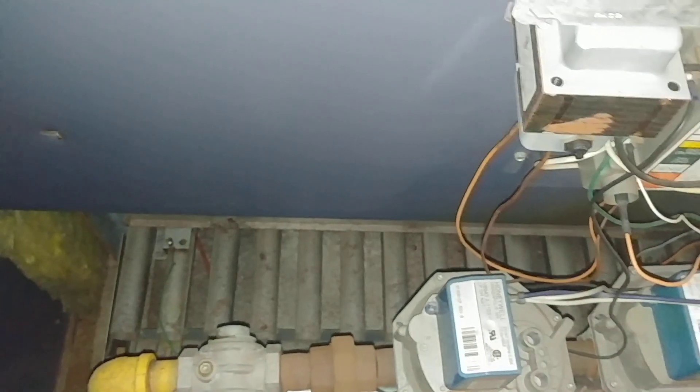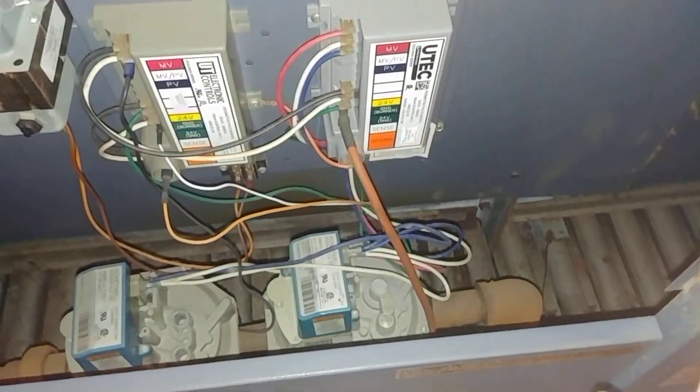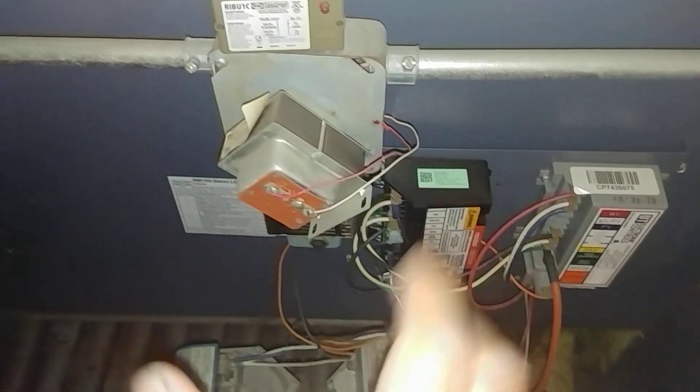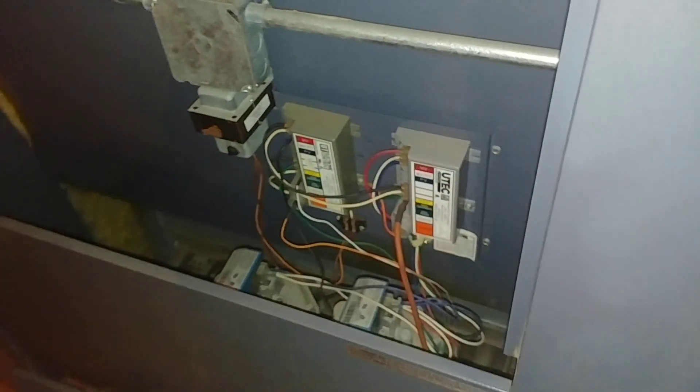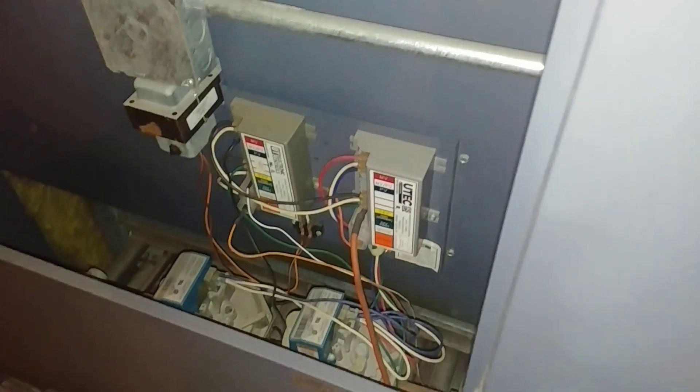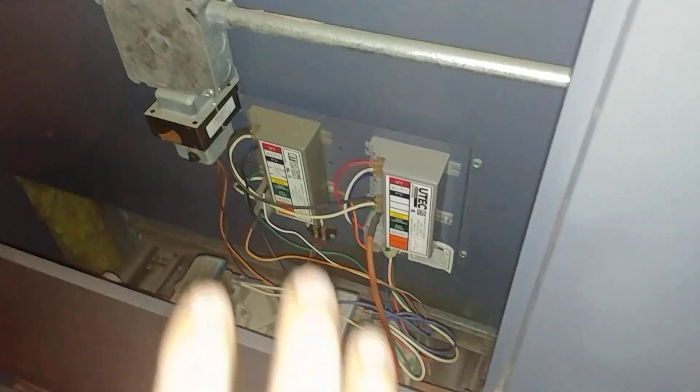There's our focus — it's two smaller boilers, but when you get this large, you have this huge burner tray, which has its own separate flame control system. We've had to upgrade this at certain points because what will happen is half the boiler will fire and the other half won't.